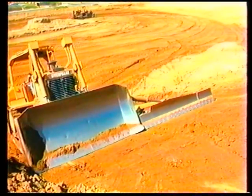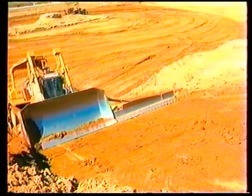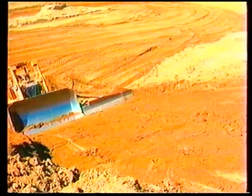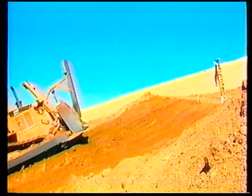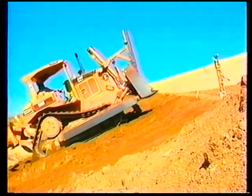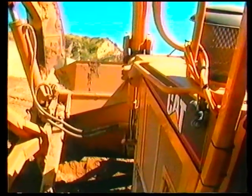It may be necessary to climb the dozer up the slope and back drag the slope. This would be done for cosmetic purposes only. It may help to blend everything together. To avoid the tracks from being clogged, keep the material on the slope moist but not wet. Track walk in the whole finished area of the slope. This will seal off the slope, hold in moisture, and help eliminate erosion. For more information on track walking, refer to grading fill slopes elsewhere on this video. Continue working across the entire fill slope.